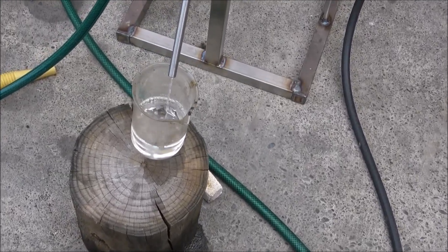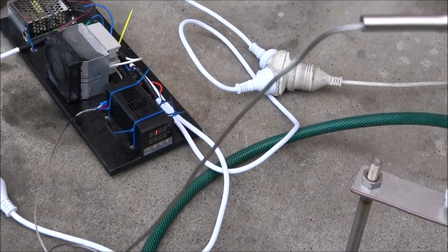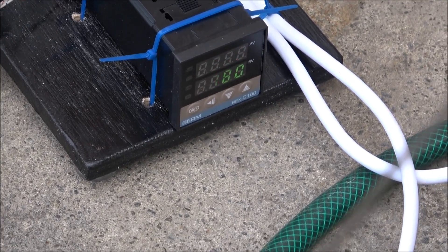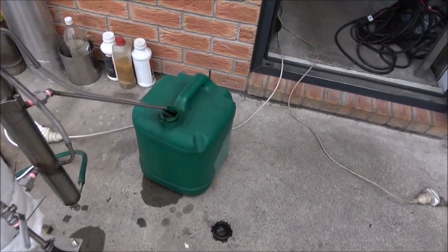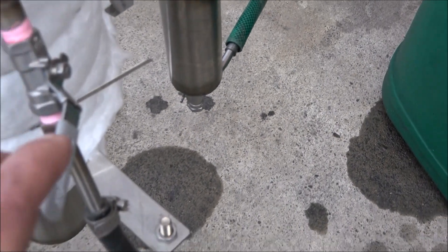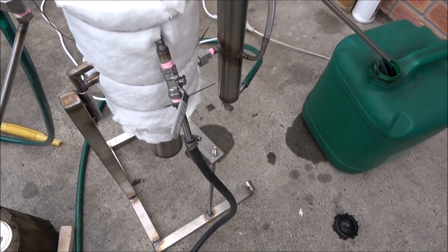You can see the complete separation — the petrol coming out is absolutely transparent and clear. Here's the control box: it's a thermal control box currently set at 180 degrees; it's at 175 right now, which is fine. Here's the diesel fraction coming out. This valve is a supply control valve, so you're technically controlling everything, including temperature, with this particular valve.